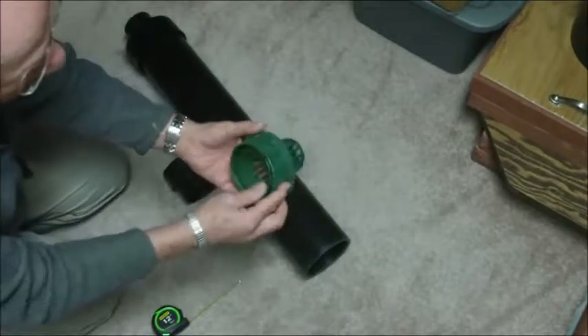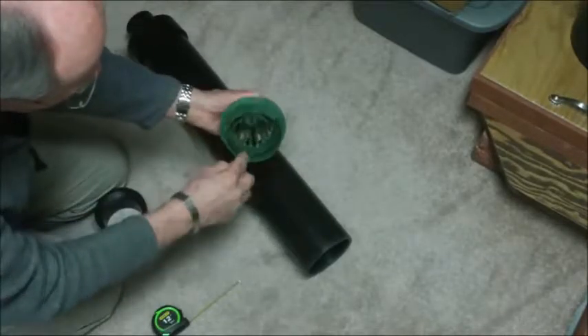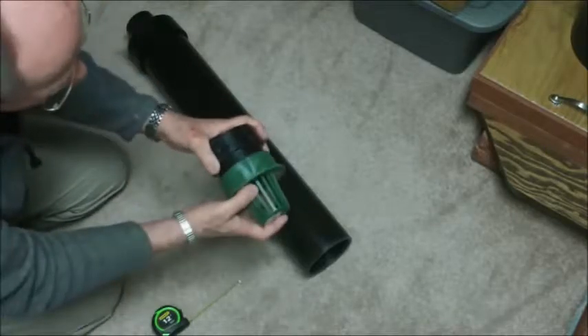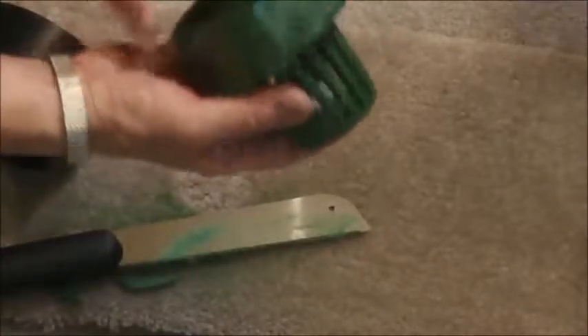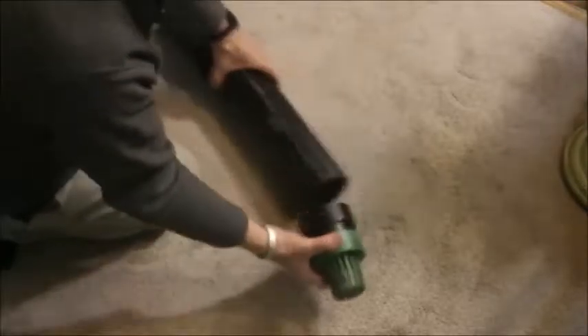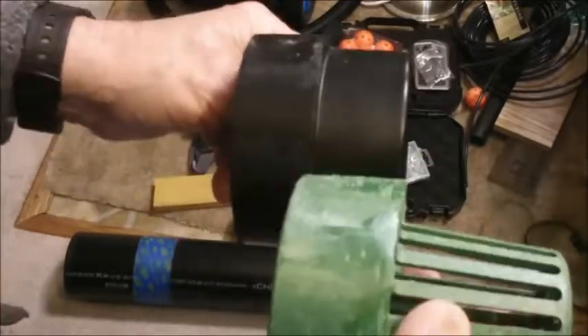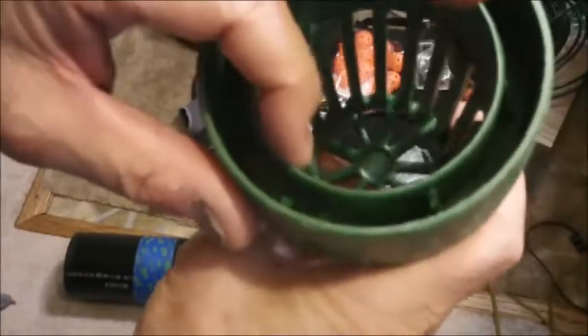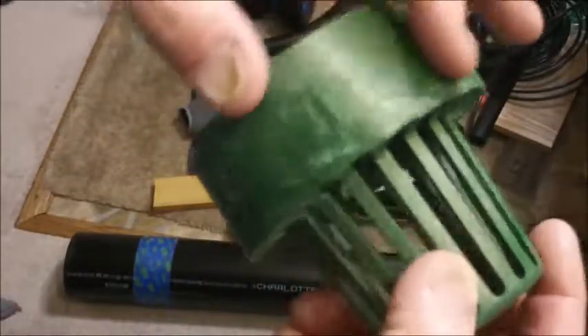This piece is just a drain that also had some tabs on it that had to be taken off. There's kind of a double channel here and it just happens to fit right on top of this. So I am cutting off this quarter inch edge manually. This just left a few little ridges. I filed this down so that both of these fit inside the four inch tubing. I would like this to slide down onto this as far as possible. However, there are some little tabs inside here that are stopping that from sliding all the way up, so I'll have to cut those off.